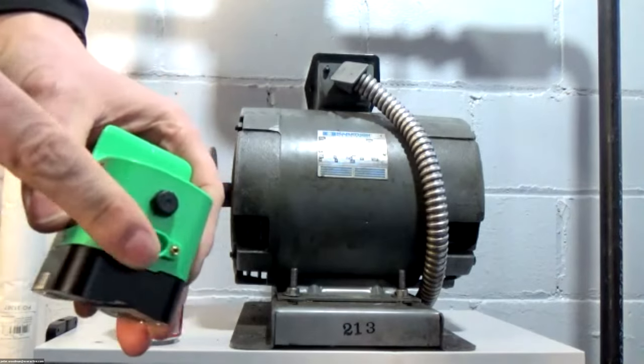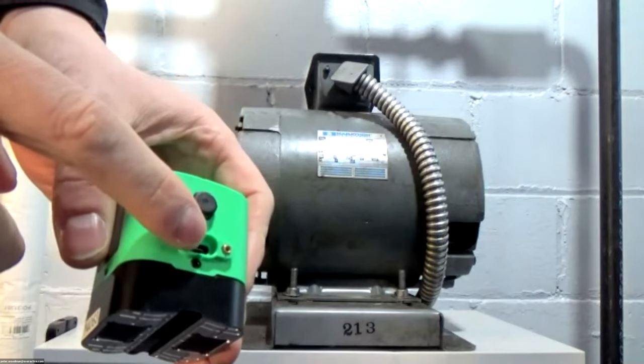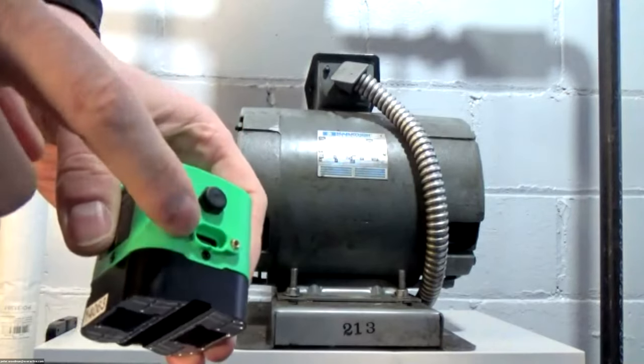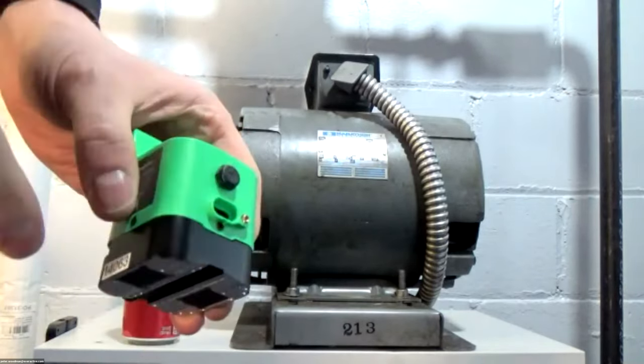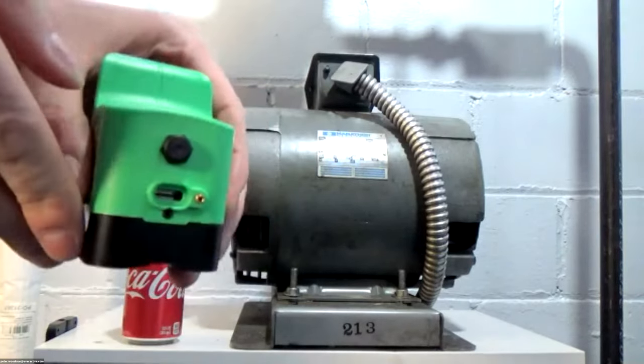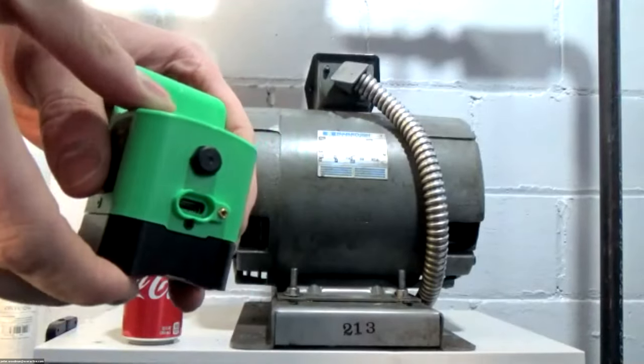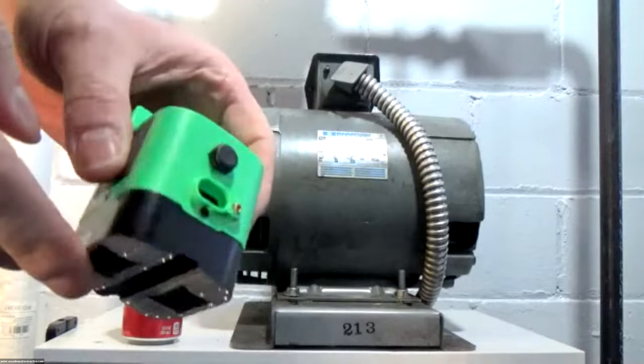On the front here, we have our cable connector that breaks out to our harvesters. That's a pretty standard USB-C pinout, but we add a safety screw and a gasket to make sure it's waterproof. All of our sensors are IP66 rated, which means they can be indoors or outdoors in all four seasons, and they can survive spray down, water jets, that sort of thing, without being compromised.